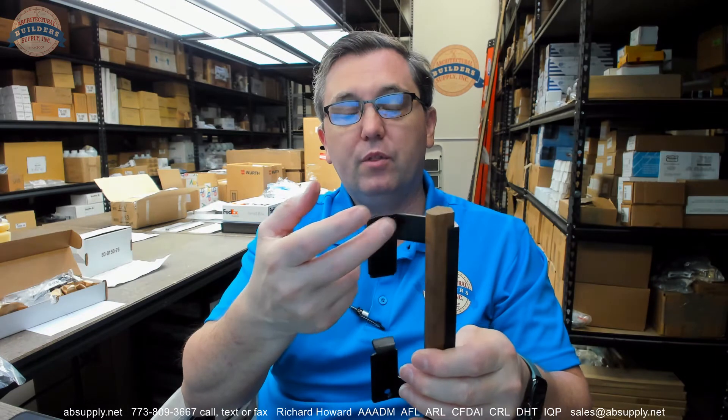They've got some paint inside of there on the fastener threads — if that happens to you, the right thing to do would be to run a tap through that. The screws that hold the lock on are just very wide thread, plastic-cut type screws, meaning the threads are intended to go into plastic. People are inherently — I see a door pull and I pull. No, it's just a slide. Be mindful that those through-bolts are there for that purpose. The fastener just needs to be coaxed in and through, and that is what it'll look like on the outside end of that.